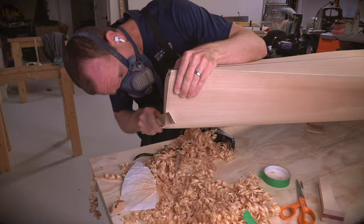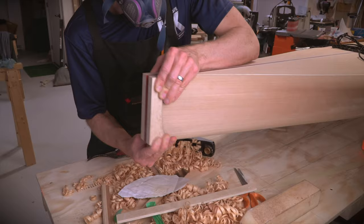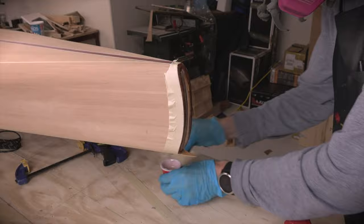Here's the tedious part. I stuck some adhesive sandpaper to the curved part of the block and carefully sanded side to side until the front of the board matched the nose block. It took a while and my fingers and wrists weren't happy, but it looked good in the end. With the fitment done, the block was bonded into place with epoxy and held temporarily with some tape.